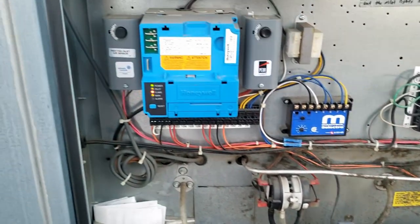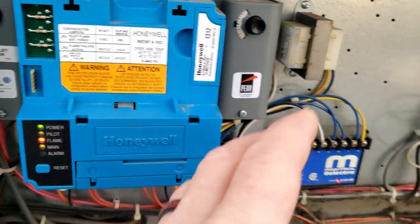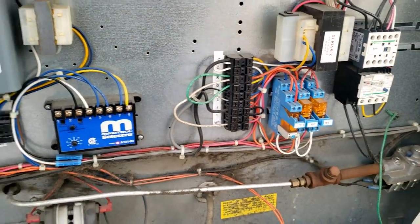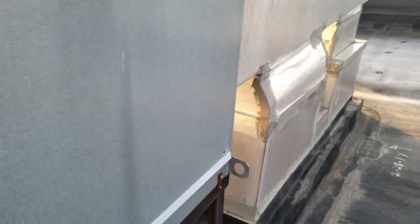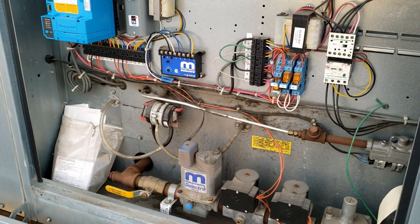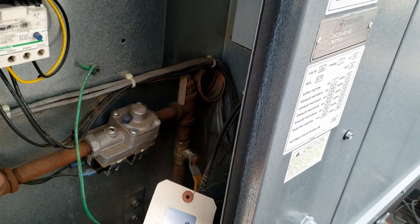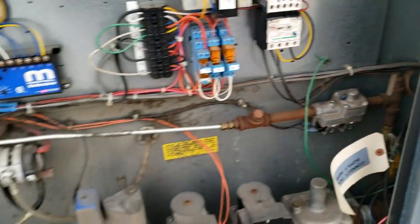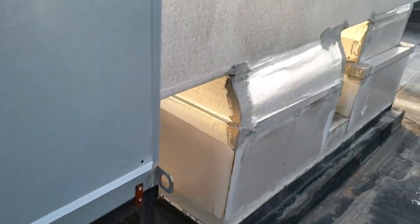The pilot is still staying on and the burner is on but it's reduced down — you can hear it drop. It's using temperature sensors inside to monitor the discharge air temperature. This looks like it has a little complexity to it but really it's not — the biggest thing is just maintaining it. Let's go ahead and see if we can see a flame through the inspection port.